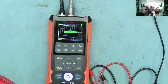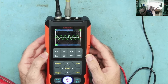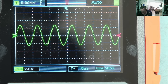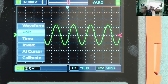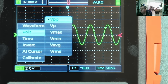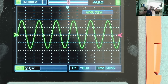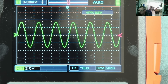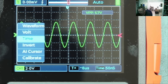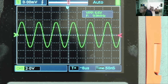I hit auto and straight away it's locked on at 10 MHz — very quickly. To display parameters on screen, hit the menu button. Let's select voltage peak-to-peak and press menu to exit. You can see the peak-to-peak voltage displayed clearly, and I can change the amplitude on my generator to confirm it responds. Then back into the menu — I'll also add frequency — and press menu to exit. There we have amplitude and frequency shown together; it's 10 MHz and working nicely.